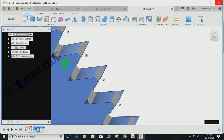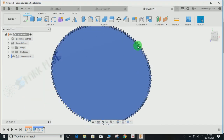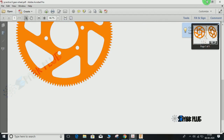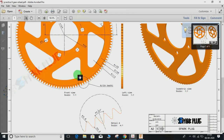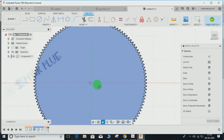The system has finished computing and the fillets have been created. Now we need to make the inner profiles — the cutouts. Create a sketch on this face. From the drawing: first make the inner circle with a radius of 40mm, then a circle whose center lies on a circle of diameter 104. Basically two circles — one of diameter 80 and one of diameter 104 — and the radius of the six cutout circles is 5mm.